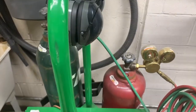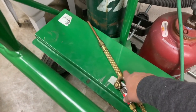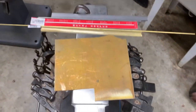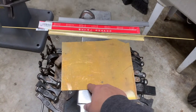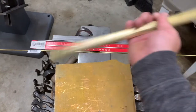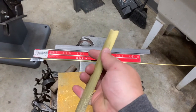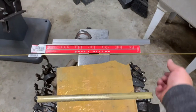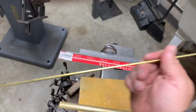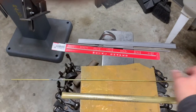On this side we've got our oxyacetylene setup — this is our big kid torch, set up with a number two tip. We'll use that for a demo on some yellow brass, joining thicker metals. This is plate brass, and then this is 360 brass — what they call machining brass. You can tell the difference because of the grain; when you get it, it's a duller color, and it has more lead and zinc content. And then this is 260 — a little brighter, and it has more copper. You can cold form this material, so that's most commonly used.